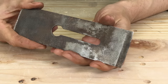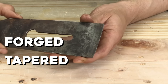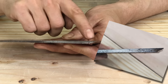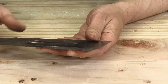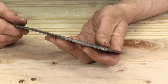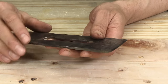With the rust removed, we can see that this old iron from a wooden plane is much different than a Stanley you might be used to. These irons are laminated, forged, and tapered — and those are big differences. Laminated means there's just a small piece of tool steel. You can see a dark line that goes from here right to here — that's all the tool steel actually in this piece. It's a very small piece put on top of soft steel or wrought iron, and then they were heated and hammered together to forge-weld them. A little bit of tool steel at the edge, and then the rest a softer, cheaper, low-carbon steel. A few Stanley irons were made laminated this way, but most were just a big piece of high-carbon steel, cut to shape and then hardened.